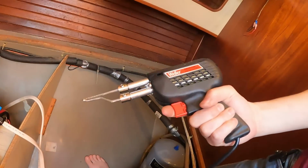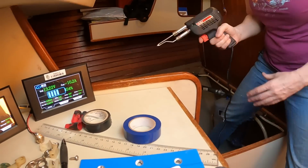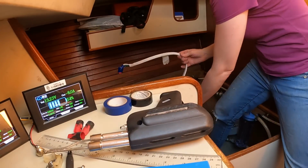I looked at the manual for the Multiplus. It's a VE bus. So I'll plug that in. The power's on right now. I'll figure out in a minute what I need to do to get that working. I'm gonna have to shut the system down when I connect the AC, so that's probably when I'll check the VE bus connection. Let's go put some solder onto the strands to make it into a poor person's Ferrule. So I'm using this gun because it can dump a lot of heat, and 10 gauge wire is a lot of heat that needs dumping. And I may have a line on some 1/0 cable.